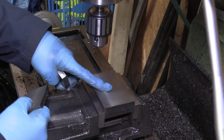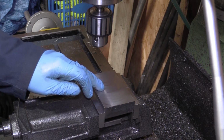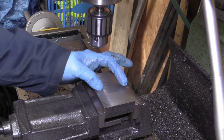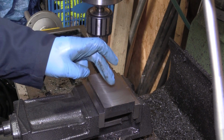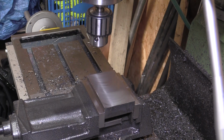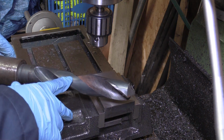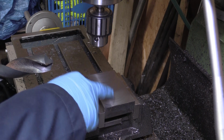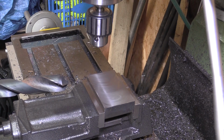It's a 25mm thick plate. So in this face of the head block we've got 6 holes to drill and tap, which will hold the guides for the vertical adjustment. We've got a big 38mm hole to put in here. I'll be going in with various size drills up to this. This is a 34.5mm drill, so I'll be using drills up to this size, and then from there I'll be putting in the boring head just to take out that last 2mm on the radius.